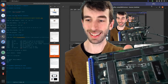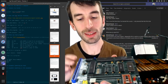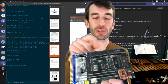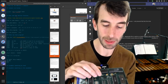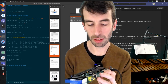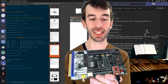Whoops, the gray, it's invisible. That's hilarious. So where's the 6502 on this board? Well, there it is. I've forgotten the name of the guy who made this, but it's a kit that you could buy with a 6502. It's got some memory there. It's got some ROM here for the program and the little pre-built programs. These two extra ICs just contain some logic gates, NAND gates, I think, 4 NAND gates in each one, just to do a little bit of tricky switching between the RAM and ROM, depending on what address is selected by the CPU.